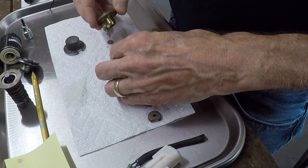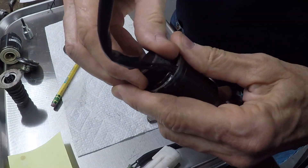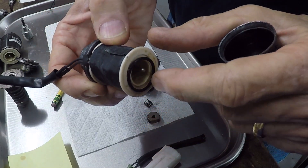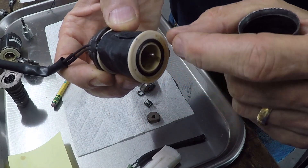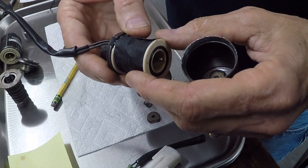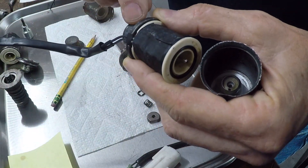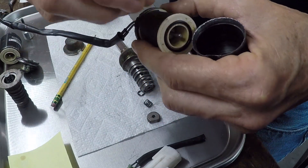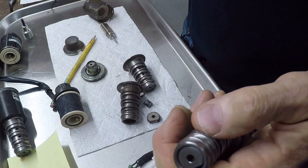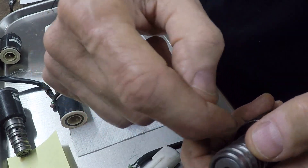Once you go inside that, this piece is in there, and this little washer rests against that. There's an O-ring on the top and bottom of the little coil — I'm going to put a fresh one in there. The fluid is supposed to be trapped out of that port here, inside the coil and back into the cap. So the outside is not supposed to get any fluid because those O-rings keep it away, so the canister should be dry. That little U-shaped horseshoe goes in there, and this little threaded end cap traps a spring in there, so that's kind of a preload against the plunger.